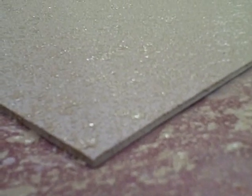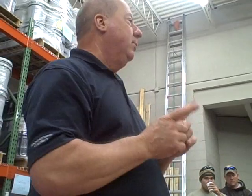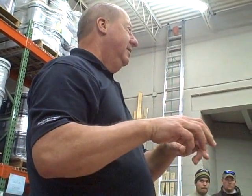Naturally you would wait for this to dry. I put the coat on here this morning and it's already dry. If this were out in the sun, in a half hour or 40 minutes you could walk on it. You could pull your tape or stencil. Picture this as a pool deck — if you went with these two colors and the umbrellas were hunter green or terracotta, you could shoot an accent color through the hopper gun like raindrops. It is really, really attractive. It looks great.